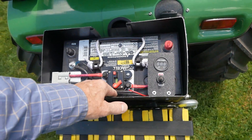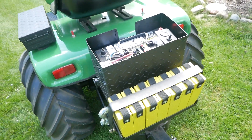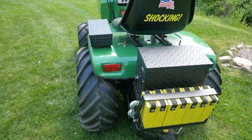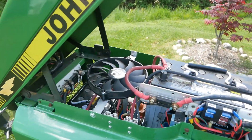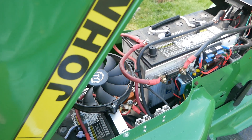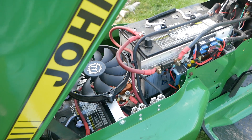I've got a 50 amp resettable circuit breaker here, and these 50 amp Anderson connectors are where it charges and where it discharges or hooks up auxiliary devices. The motor is mounted on a metal plate fastened directly to the chassis of the tractor. When I had the vibration problem with the rag joint drive shaft, I thought maybe the motor needed to be suspended — so I used hockey pucks in between the metal of the motor and the metal of the chassis. But it wasn't that — it was the drive shaft.